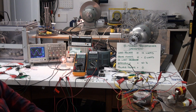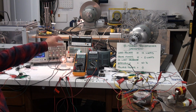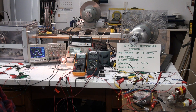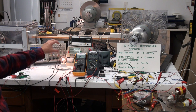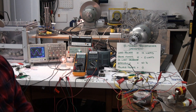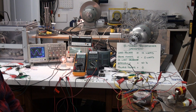We're delivering about 12 watts to the load. The prime mover consumption has gone down, or increased by zero watts. We can see the primary current and voltage are 90 degrees out of phase. What that means is real power is being delivered to the load from the secondary of the bi-toroid transformer, while reactive power is being delivered to the transformer's primary.